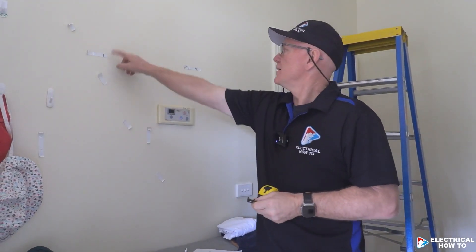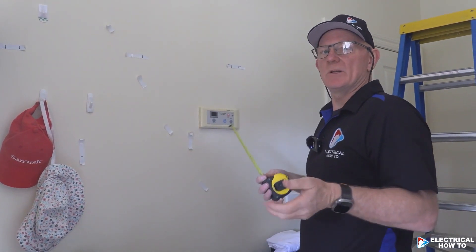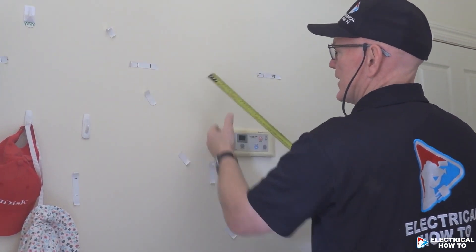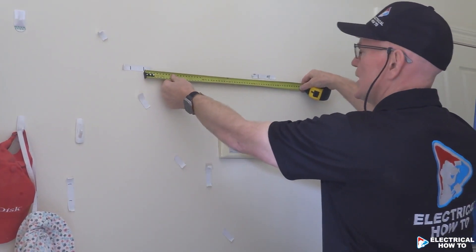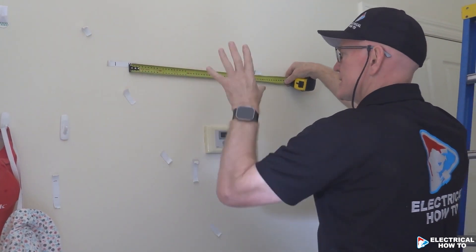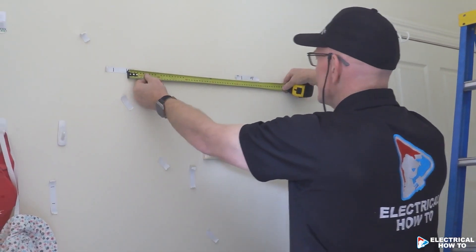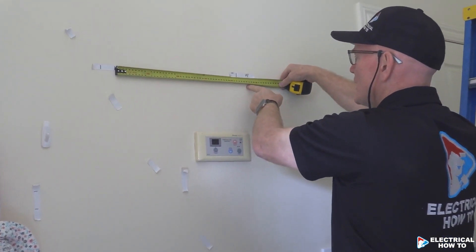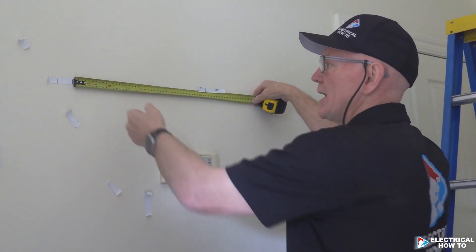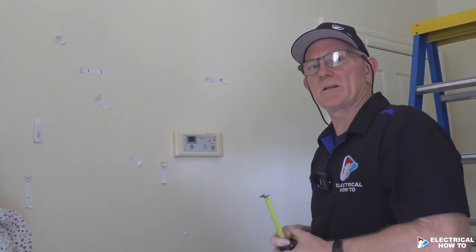We're in the laundry where we're going to cut a section out to put our internal subboard in — our flush mount. Another advantage of the Clipsal switchboard is it's 419 millimeters wide. We've found our stud and a metal beam, so we'll come down through here without cutting the internal bracing. Measuring between the studs, we've got about 422 millimeters, and the Clipsal is 419, so it's going to fit in nice and snug. We can run three or four screws down each side to make it strong. If we went the Hagar, it's 460 millimeters wide, so we'd have to cut part of the stud on both sides — a lot more work. Clipsal is definitely much easier to install, so we're going with Clipsal on this install.